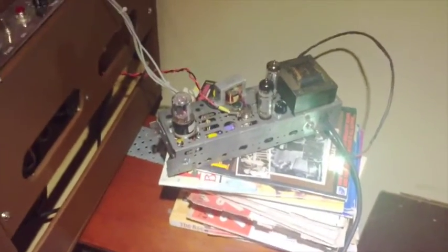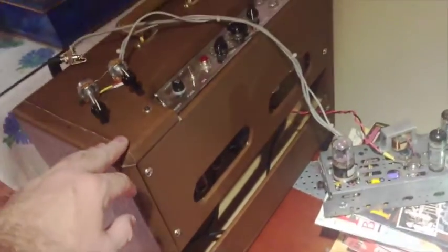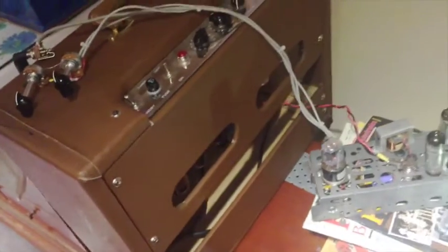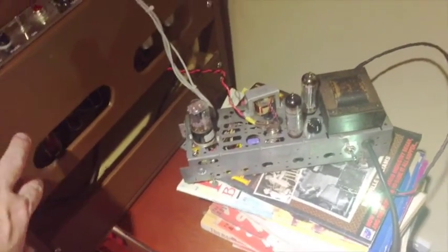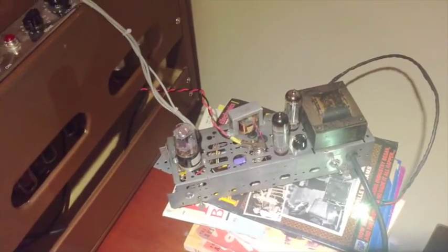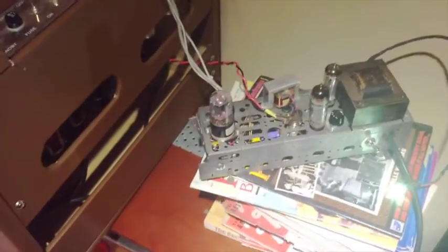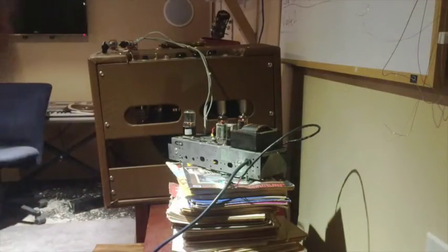For this demo, I'm using the internal speaker of another little homemade amp I did — a Fender 5E3 clone. That speaker is rated at 8 ohm whereas this amp is more suited for 4 ohm, so you're going to get about half the power. The output power on this is only about 3 watts into 4 ohm — not very high, but that's all Andy wanted. I've also got a little neon indicator. Let's have a listen.